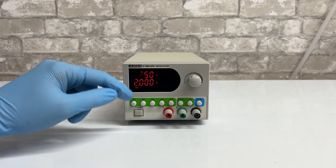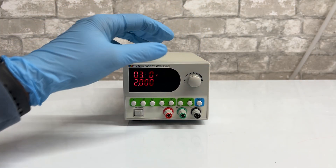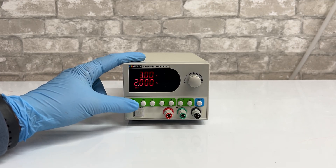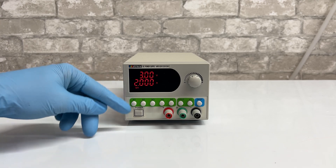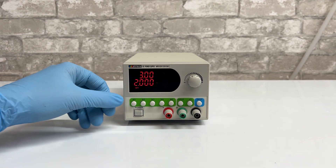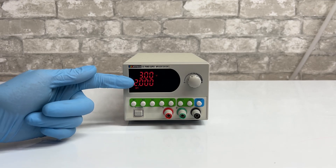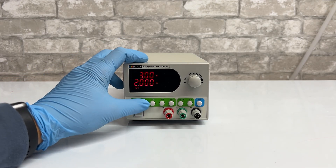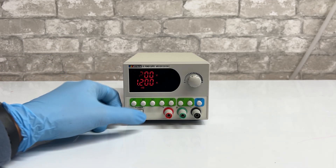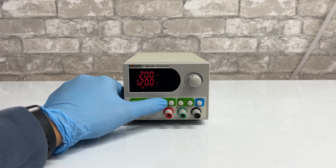To preset a specific voltage or amperage, first adjust to what you want — for example, 3 volts and 2 amps. Then press and hold one of the mode buttons for a few seconds and it will save that voltage and amperage to one of modes one through five. For instance, on mode three we have 15 volts preset with 4 amps, and we just set mode one to 3 volts with 2 amps. This is great for electroplating when you have jobs with multiple items requiring different amps or voltages, and also for brush plating where you can have one voltage for base coats and another saved for final plates.